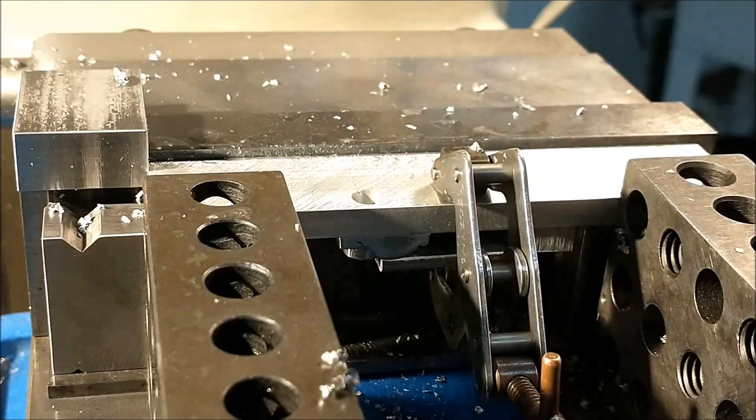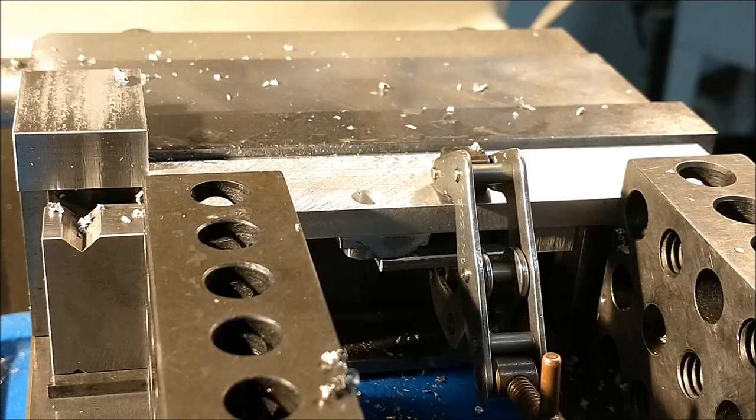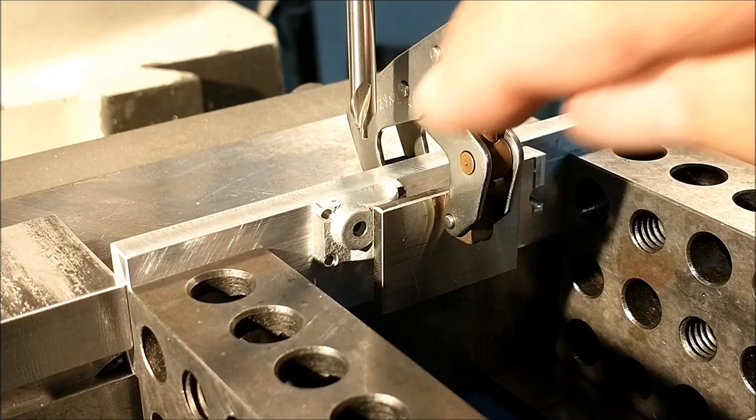Part still feels really good. The whole fixture plate is up against the stop here, so I can go vertical with the plate now and maintain the center line here for the off-axis shift for that feature over here. Knowing exactly how thick the plate is allowed me to edge find the back of the plate and move forward to the split line. If you want to pinch whatever's going through here, stay on that side of center. If you want it to float freely, stay on this side of center. I'm going to try to hit it right on the edge.